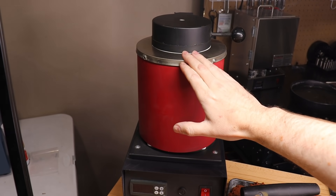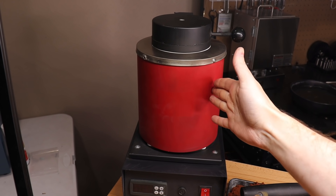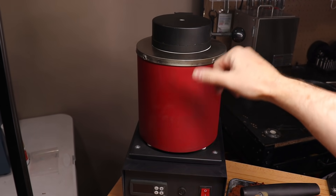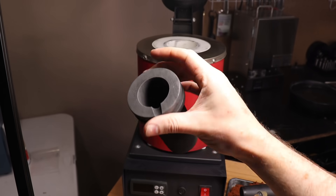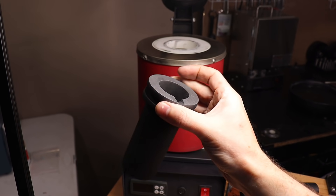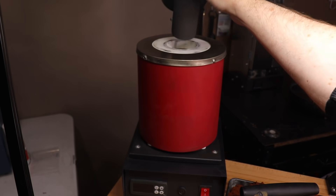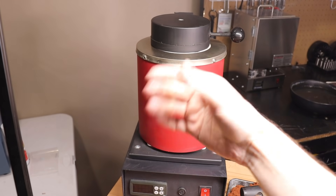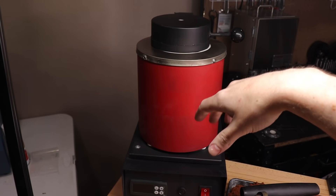If you really want to go for it, you can get a furnace like this — it goes up to 2000 degrees and will melt down your metal for you, but it takes a while to get up to temp, so I'm not going to be using it for this video. You can fill it up with silver, gold, brass, copper, whatever you really want, and let it sit until it heats up to the proper temperature. Make sure to look up your temperatures for each metal, as they have different melting points, and you can pour it directly from there.